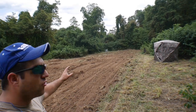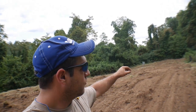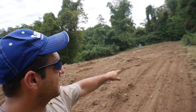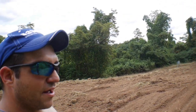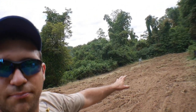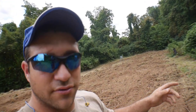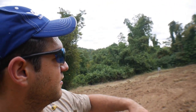So here's what we ended up with. We did all this with the box blade — what I was doing was dropping down the box blade and lifting it back up to get all that dirt out of there to get the tines cleared, so they could sink back down in the dirt. I just kept doing that. That's where I was getting the most ground tillage, was lifting it up and dropping it back down. You probably noticed there are humps out there. What I'm going to try to do is get the '57 Ford tractor running — it's got the disc on it — and we'll come out here, disc it, make it all smooth, and then we'll be ready to plant.